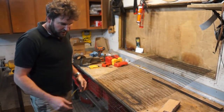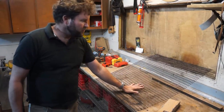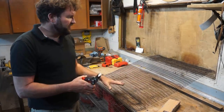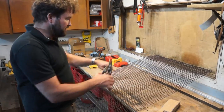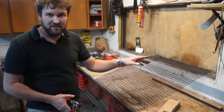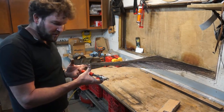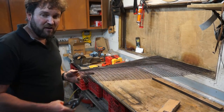For the lid we're going to do the same or similar construction to the sides — we put a little 90-degree bend on each end, which keeps everything rigid. The lid has four sides that need support, so we do a one-inch bend on each side. To allow that, we need to cut a little one-inch notch out of each corner, otherwise we'll end up with a messy fold, which isn't desirable for wire.